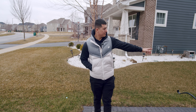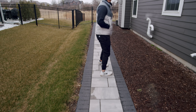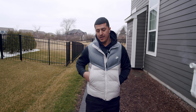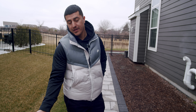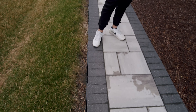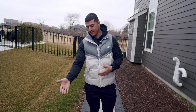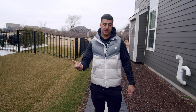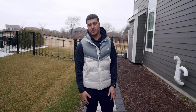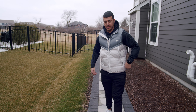Simple project — a service walkway that leads to the back to a patio, I think it's a 40 by 15. Another thing I want to talk about — full transparency here — is something we did stop using, and that's the plastic edging. Nothing bad about it, but as you can see with time, it does tend to start popping up with the freezing and thaw cycles after four years. So we switched over to our concrete edging with fibers in it, which is definitely a lot better for the freezing and thaw cycles that we have here. That's one thing that we changed over the years.